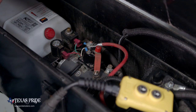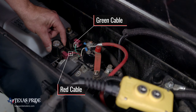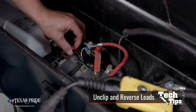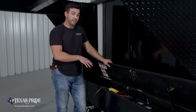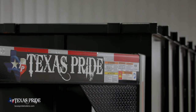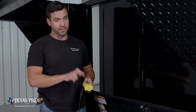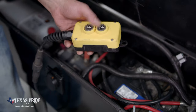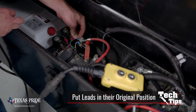There's a very easy way to isolate that. If you're looking down on your solenoids, the top leads have a red and a green — the green goes to the square solenoid, which is your down, and the red goes to the round solenoid, which is your up. What we're going to do is unclip those leads and move the red to the square and the green to the round. All we're doing is changing the power flow from the buttons, so now our up button on the remote is actually going to be our down and our down is going to be our up. If swapping those leads makes the direction that didn't work previously work now, there's an issue with the remote itself. If swapping the leads did nothing and it still won't go down or up, there has to be an issue with the solenoid. When you're done with that step, make sure you swap the leads back to their original position — the red going back to the round solenoid and the green going back to the square.